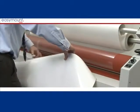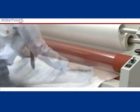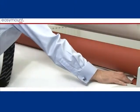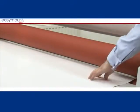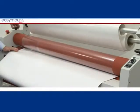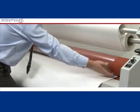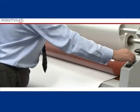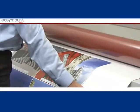Place your backing paper on the bottom roller as demonstrated and line up with the top roll of film. Lift the rollers to their maximum height and thread the backing paper over the bottom roller and out of the exit plate. Load the laminating film on top and thread as before, adding tension if required to ensure there are no creases in the film. A print can then be sent through the machine that is narrower than the laminating film without the adhesive sticking to the rollers.